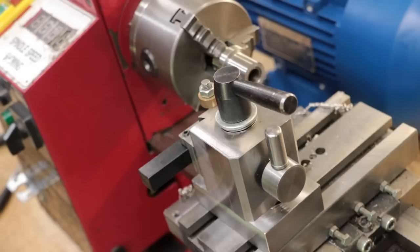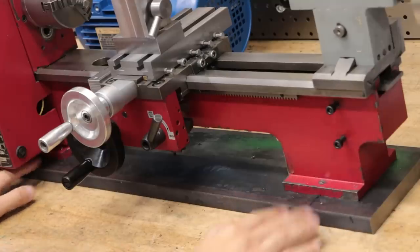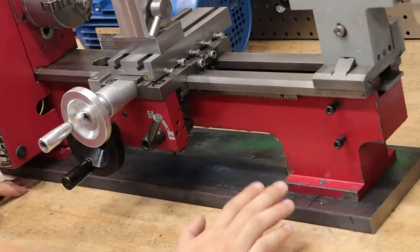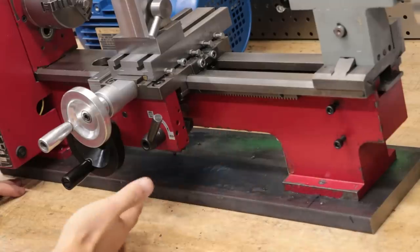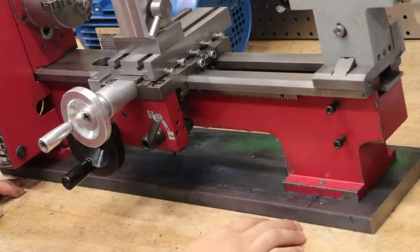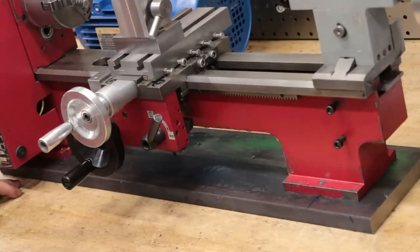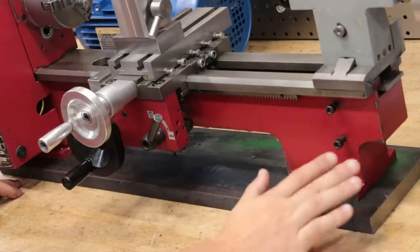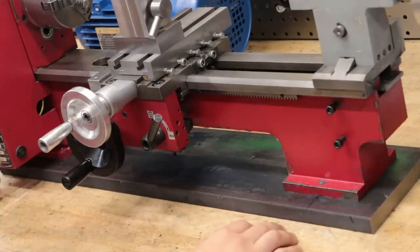The guy who made it says it should be okay. That said, I highly doubt the plate I used was perfectly straight and flat, being hot rolled steel, and bolting the lathe to it will probably have twisted it to some degree. A twisted lathe bed will cause it to cut tapers. Fixing it is usually straightforward — you can shim it to lift some corners and take the twist out. It's something I've done in the past since the bed was slightly twisted from the factory, and I'm planning on doing it again in the future.